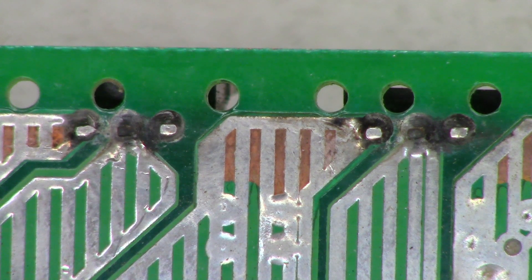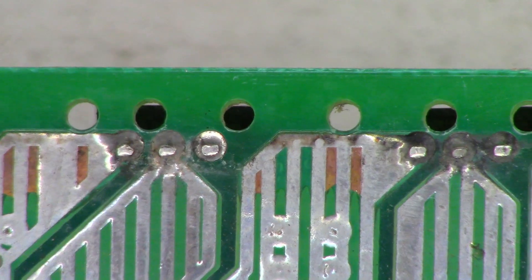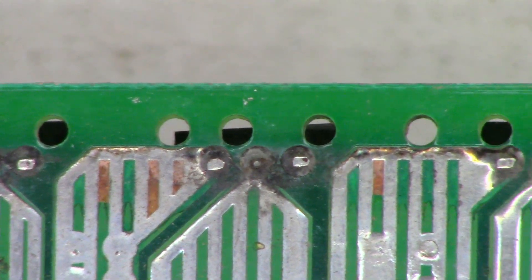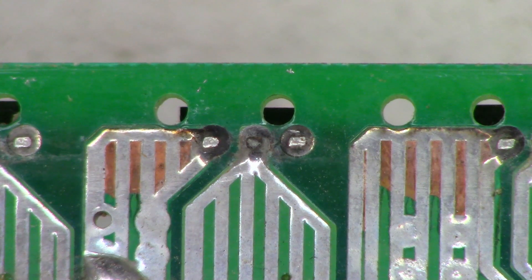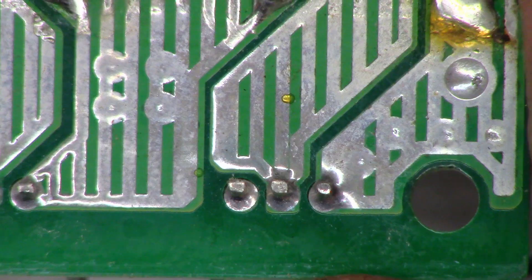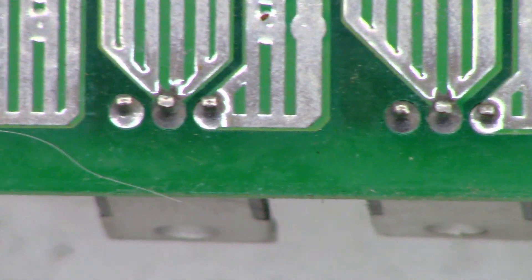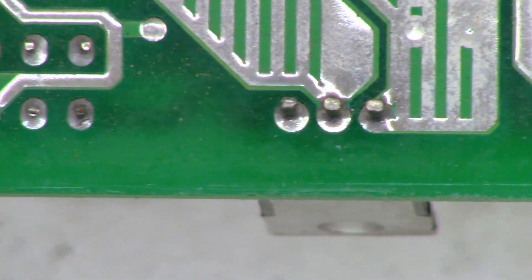Take a look at the leads on those two FETs — you certainly see some arcing. The rest of them don't look too terribly bad. I still see a little remnants of arcing, maybe some arcing on that one. That one does not look too good. It's definitely been wet — look at the color of the center lead there. Same on that one. Let's go to the other bank now. Good, good, good, good, good, good, good.